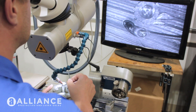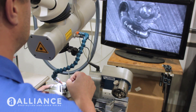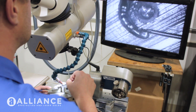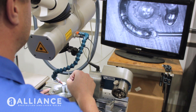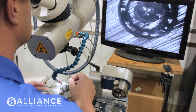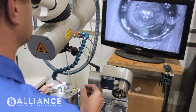We are welding 20 thousandths aluminum on the end of a core that was cut a few thousandths too short. We are using 20 thousandths rod at 15 hertz, just to show the feasibility of welding aluminum with a fiber laser welder.